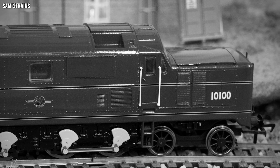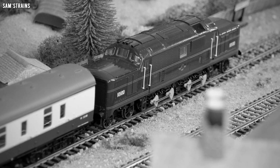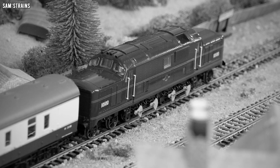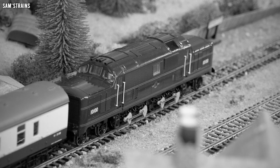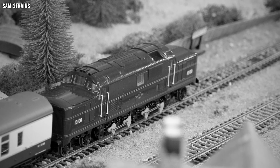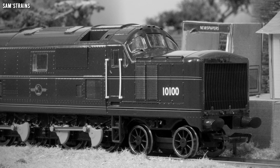The Fell was intended to address some of the perceived weaknesses of the diesel locomotive concept, and it was designed to be lightweight but extremely powerful, in fact exceeding the power of the Class 5 4-6-0s of the LMS. The Fell was unusual outwardly as a result of its 4-8-4 wheel configuration, featuring those coupling rods, which is quite odd for a diesel, I suppose. The centre set of rods was eventually removed, but the wheel configuration remained 4-8-4 and not 4-4-4-4, which would have been even more bizarre because all of the drivers were still driven by the single gearbox. Internally though, the design was even stranger, as it didn't have different gears as such.